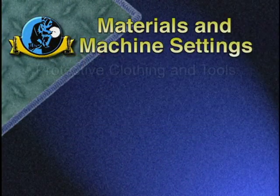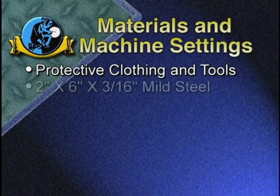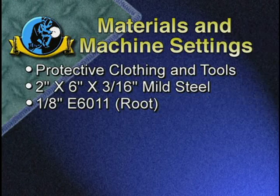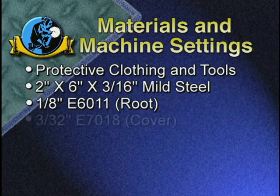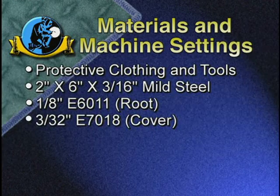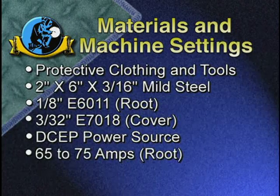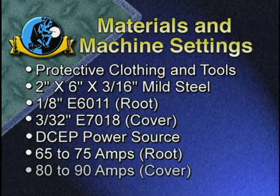In addition to your protective clothing and tools, you'll need several 2x6 by 3/16 inch mild steel plates and 1/8 inch E6011 electrodes for the root and 3/32 inch E7018 electrodes for the cover. Set up the constant current power source for electrode positive and set the amps to between 65 and 75 for the root pass and 80 to 90 for the cover pass.